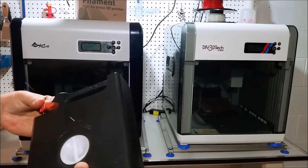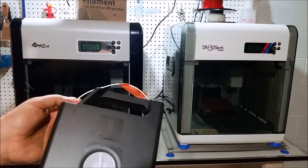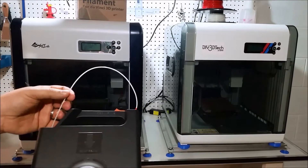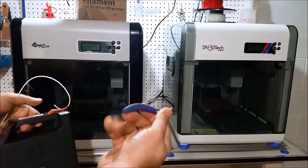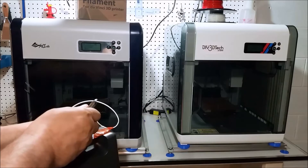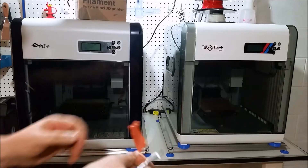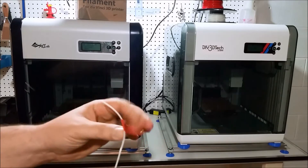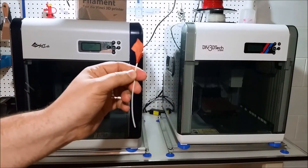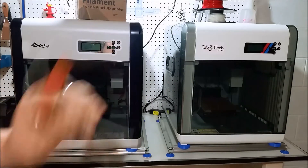To prepare the cartridge, unlock it, pull the tape off, and pull out a little bit of the filament. Then take a pair of cutters and cut the filament on an angle. Don't try to reuse that little piece because it'll have goop on it from the tape and can cause problems. By cutting it at an angle, it will help it feed into the extruder more easily.